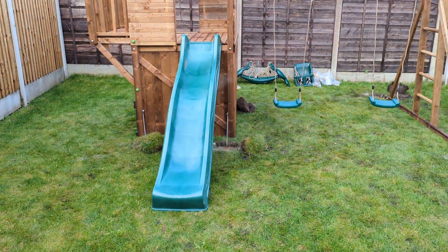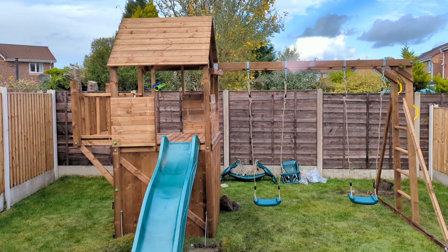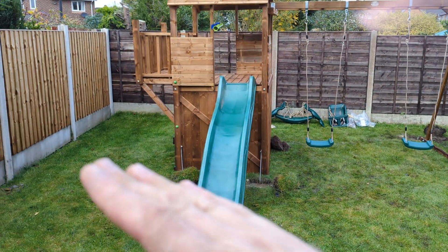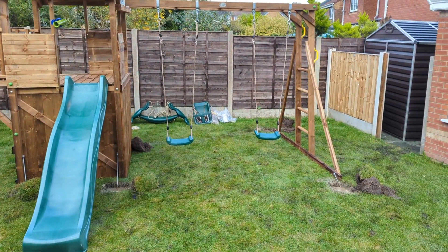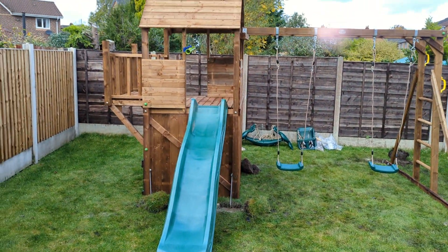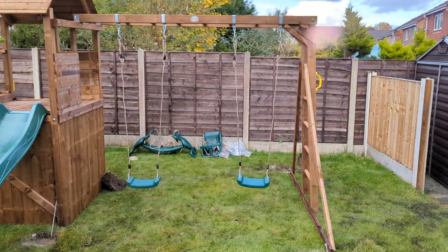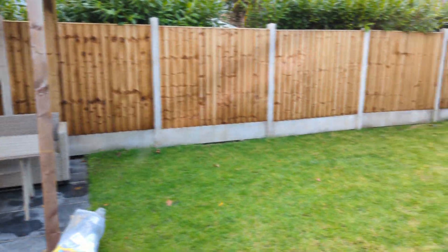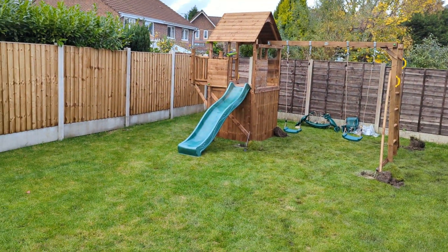Anyway, that's the balcony fort in Bolton. If you want your climbing frame built then I'll do my best. If you've got a flat garden I'm certainly very happy; if you have a slightly sloping garden we need to look into it and work out what to do, because if you start cutting the posts into the ground you start losing bits of the playset and they rot very, very quickly. We dug in a few of these a good few years ago and we're now getting recalls — the wood has literally been eaten by worms. They're not meant to be dug in; your garden is meant to be flat. As you can see here, this has all been landscaped very recently, but it's just half an inch out and you've got a slightly sloping playset.